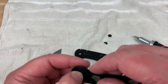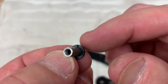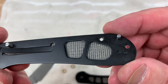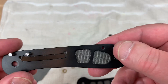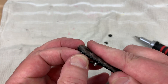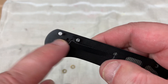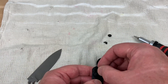I don't like my bearings facing that way. You can see that little machined area under the pivot cap, and that mates up under here — it's hard to see because of the micarta. They've done some weight relieving through here — they skeletonized the liner, also in here. This pin is your lanyard hookup, and of course these are your stops for open and closed. You don't need a steel washer because you've got steel liners, but you do need bearings.